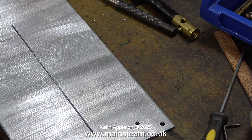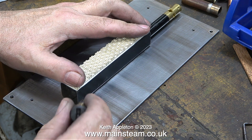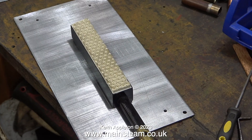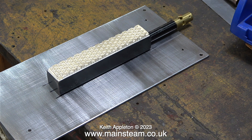After making four center pops on the piece of metal I drilled each of the holes - 5/32nds of an inch in diameter. Here I'm showing the top of the metal plate and I've drawn a line exactly down the middle; this gives me the position for the burner. I can't fit the burner until the boiler is sat on the plate, which will show me just where it needs to be fitted. I'm using my favorite engineering method - a felt tip pen to draw around the part. This burner should be okay for a 501; normally on a 504 boiler the original spirit burner had two burners, but for the 501 and 500 it just had a single burner tube, so I'm emulating that in a gas form.